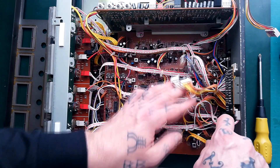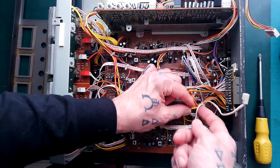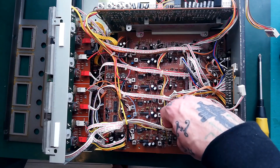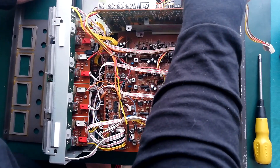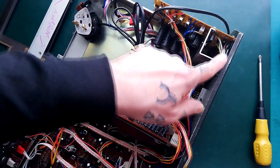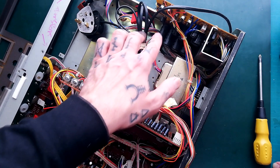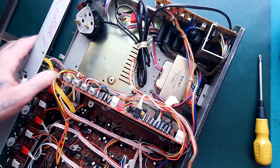On the other side there's a little two-pin Molex connector, tied up with some cable ties. Following it around, this seems to be coming from the power conditioning board. You can see all these filter capacitors and rectifiers in there. That's the board taking the output of the AC step-down transformer and turning that into direct current that can be used by the rest of the system.